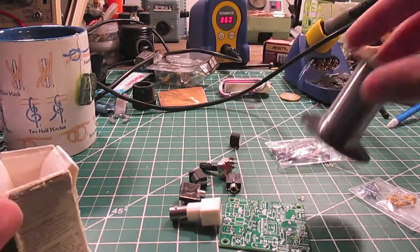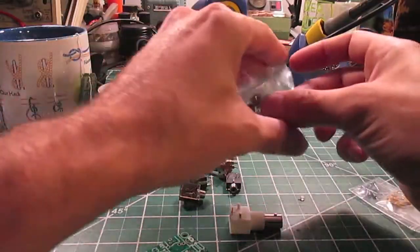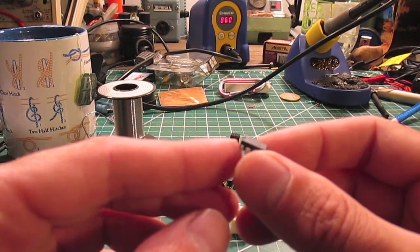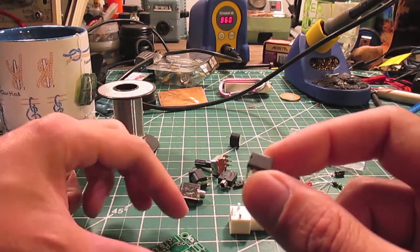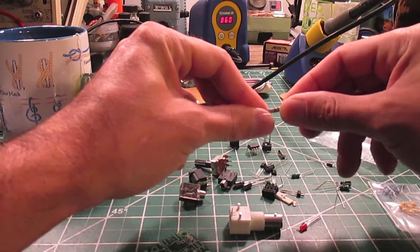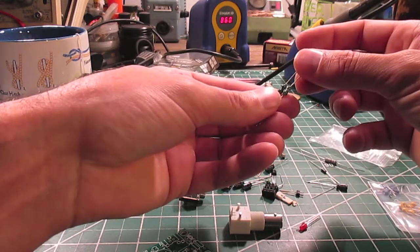Good old Caster 44. This is an LM386 — a little amplifier, pretty typical chip. It's like a little driver for a small speaker, probably for some sort of audio output. Got a bridge rectifier here. Crystal — 7.023 megahertz. A resistor, and these are inductors. Hopefully all the same value... of course not.